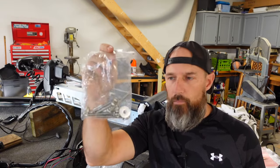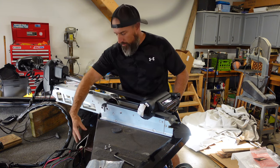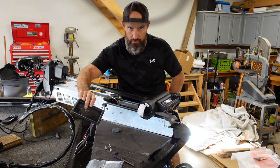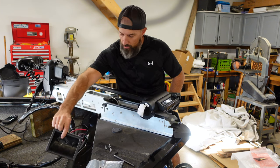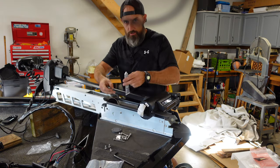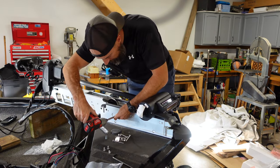Now you're just going to want to use that bag — this is what's gonna mount it on. To get in under this, I ended up taking off a little piece in the front of the boat. This is where I'm going to plug in my trolling motor — that plug I had to buy separately because every boat has different plugs. I took it out so I can stick my arm up inside there and connect the nuts. I'm going to put some anti-seize on some of these bolts just in case I have to take this back off.